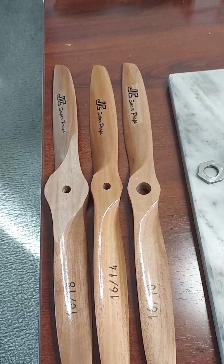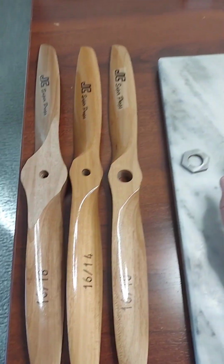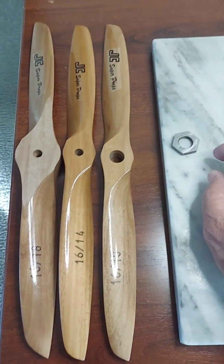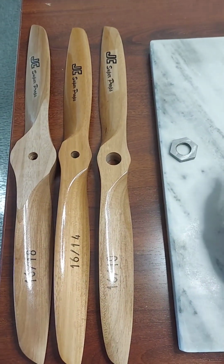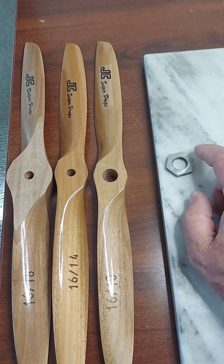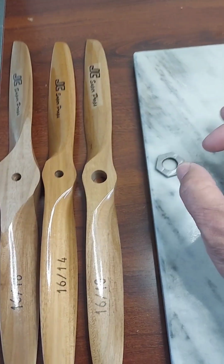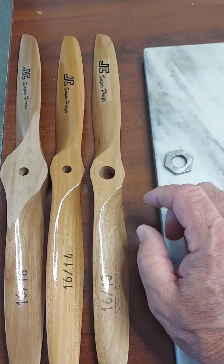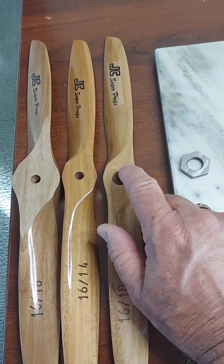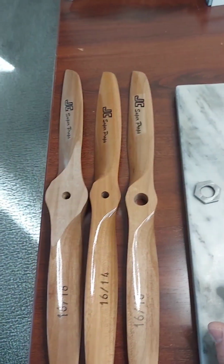And I mentioned this to another buddy of mine, and he went even one step further and said, well, if you're going to make a spanner nut out of it, you don't even need the flats. You could get rid of all those corners and round it off, make it round, and really reduce the OD and really reduce the size of the counterbore that you're going to have to put in there.